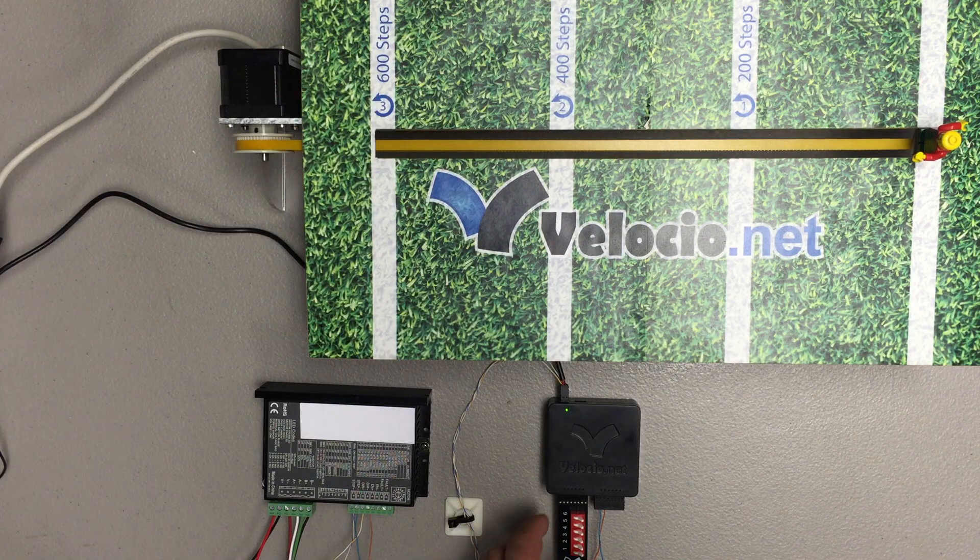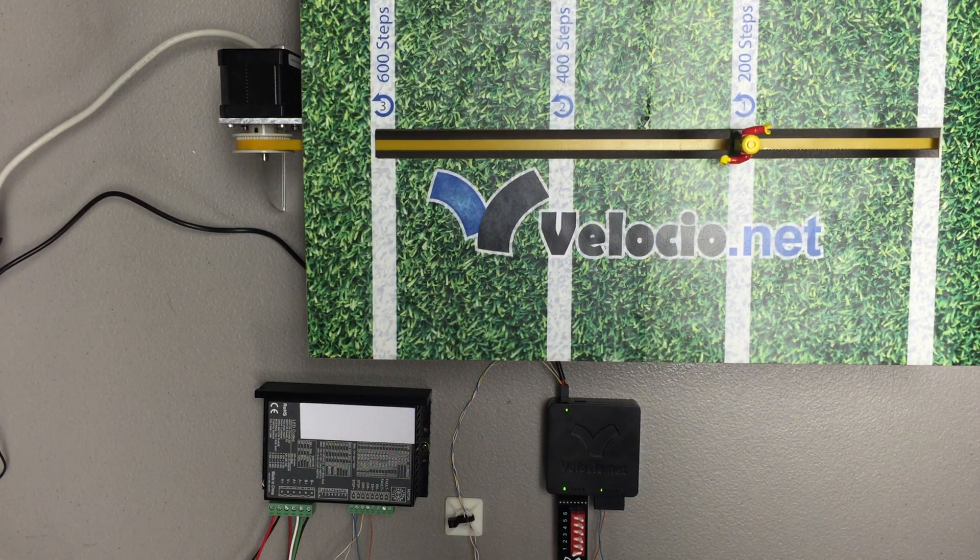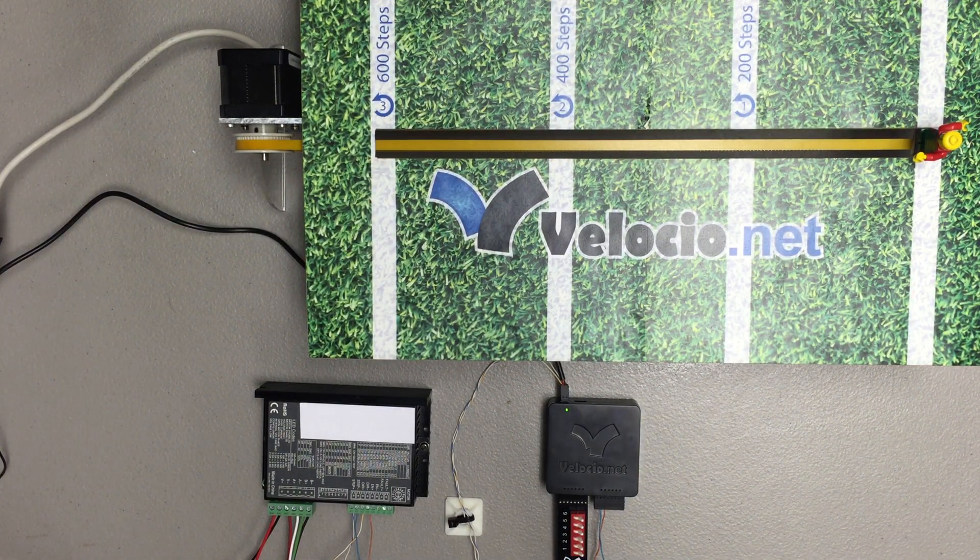I have a simulator stick plugged into this PLC and it's gonna kick off the motion, so we'll see it run. We'll turn off the input so that it only does it the one time — if we left that input on it would continue its sequence.